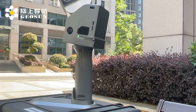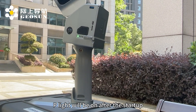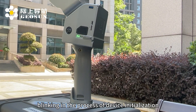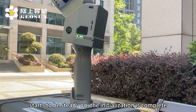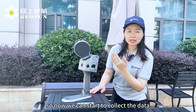Next, we put the GS100G on the ground to power on, and wait for its initialization, which takes about one minute. The GS100G has four indicators: P, T, L, and G. The P light will be on after startup, and the L and G lights will continuously blink during initialization. When the T light becomes steady, the initialization is complete.